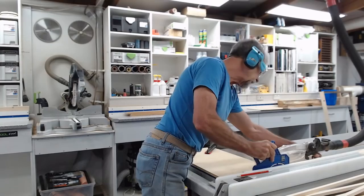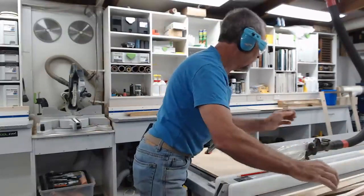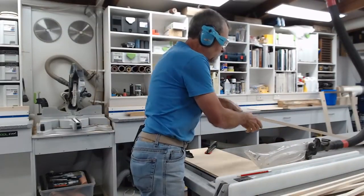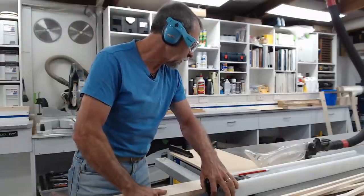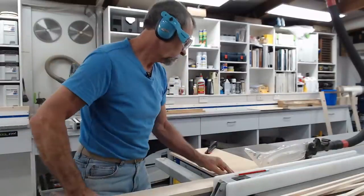Now also at the back here I have the splitter that holds the guard up, and that splitter is protecting me from anything going back and touching the back of the blade that's on its upstroke. So whilst I'm reaching around at the back, some people might think that's a bit dangerous, but if you've got the guard on with a splitter, it's pretty safe.